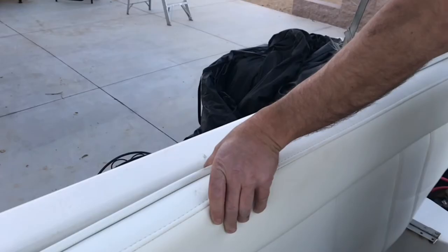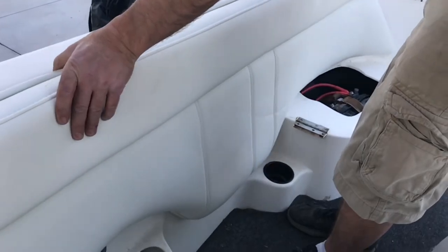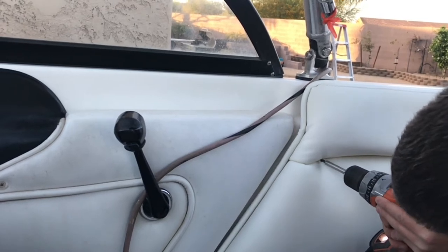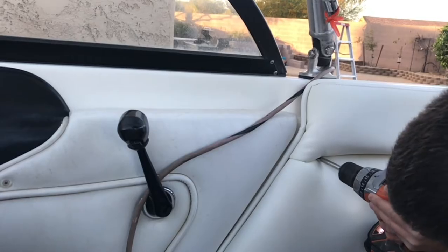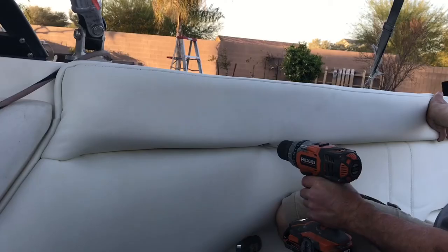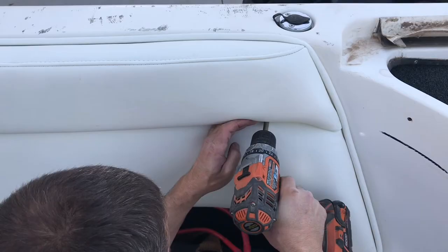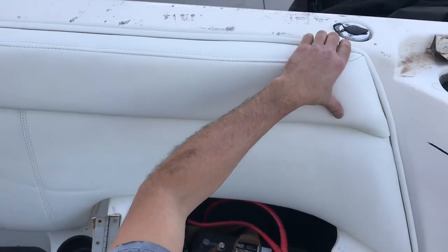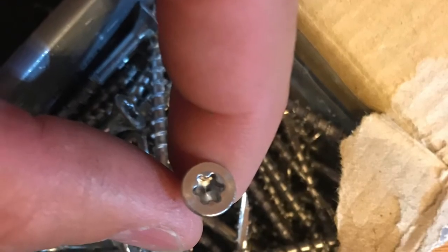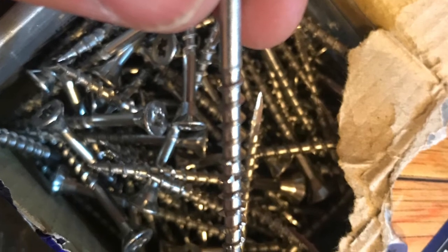When reinstalling the panels, at first I tried using the same screw holes — that just didn't end up being practical and was a big waste of time. I also learned not to put the front screw in and then jump to the back screw; that caused binding in the middle. It's easier to start at one side and work your way down, having somebody hold the panel in position as you screw it in. I also recommend using a drill with torque settings so you do not over-tighten and pull through the material. I highly recommend not reusing old screws — they might break going back in.